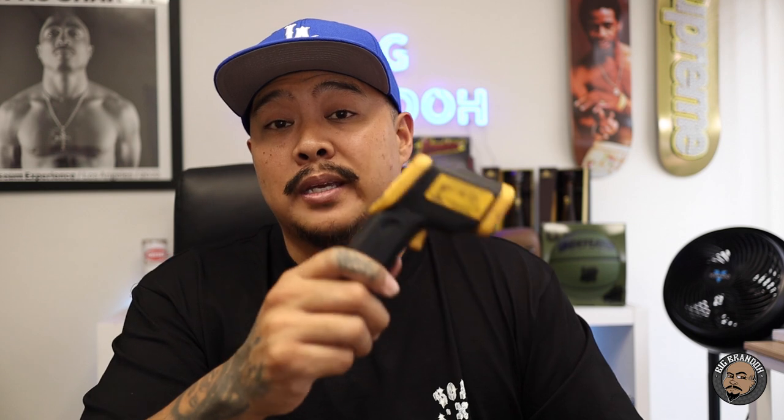I never go based off the readout on my screen. I shoot the laser thermometer onto the top heating platen until it says 350, and if it doesn't, I toggle the temperature until it reads what I need. A lot of people want to shoot this in the corners and edges, but if your design isn't on the edges, that temperature makes no difference. All you want to make sure is that wherever the transfer is going to be laying down is at the right temperature. I shoot it directly in the center, or wherever the transfer will be. Everything I show you will be linked in the description - just look up laser thermometer or infrared thermometer on Amazon, Home Depot, Lowe's, or Harbor Freight. Very cheap.